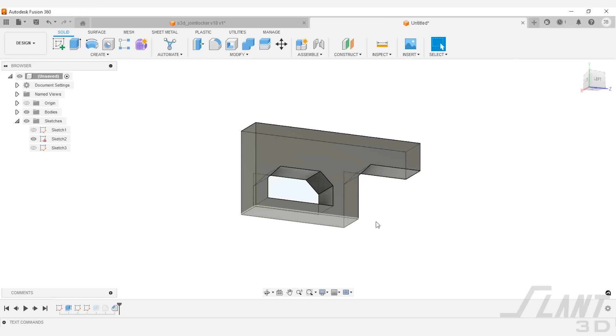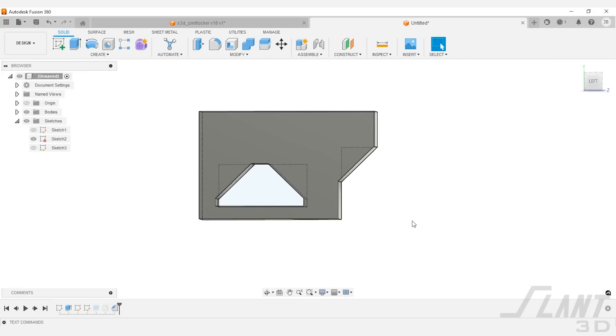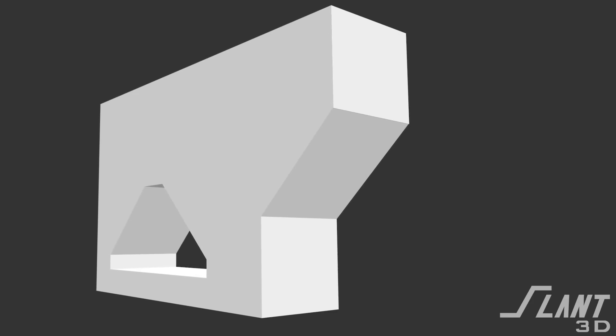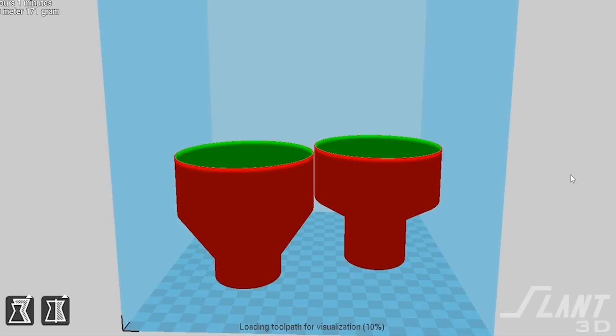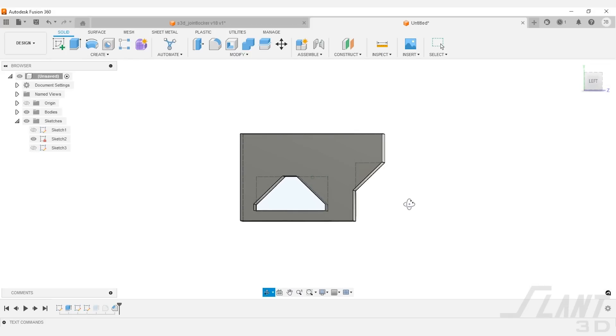The most optimal option is to use chamfers. Chamfers are great because they actually eliminate the need for any other sort of support. Since they are a 45-degree angle and a consistent angle all the way up, you no longer have the sudden horizontal feature that can come with standard fillets. Fillets have that issue; chamfers do not. You can actually go all the way to the tip so that no support is needed anywhere. Chamfers are really awesome because they have no exterior need for post-processing — the part could come off fully complete. The machines can automatically eject parts, move on to the next one, and produce hundreds of thousands of this part more affordably and scalably. So when you can use chamfers, this is really the option you want to use.